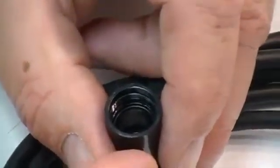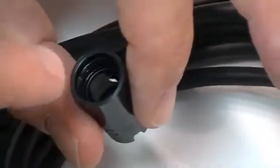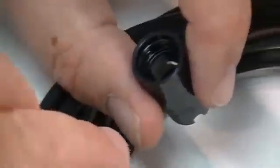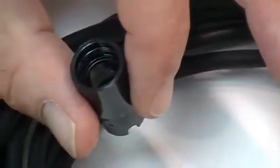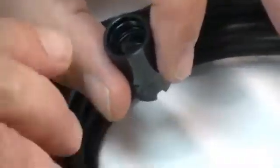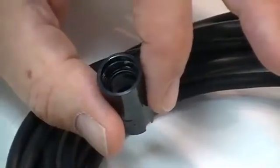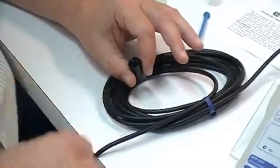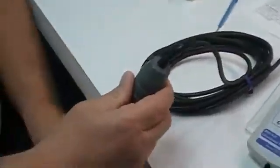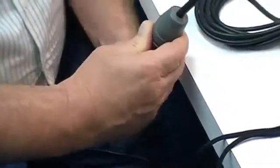When you've got the electrolyte just short of the O-ring in your membrane, look down through the membrane onto a white surface and look for any air bubbles inside the liquid electrolyte. This is where any calibration procedure will fall apart, because there must not be any air bubbles inside this membrane before it's installed onto the end of your probe. Once you've established that there are no air bubbles, take your probe, put it onto the bottom, and hand-tighten the membrane onto the probe, then let it hang back off the table.